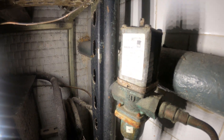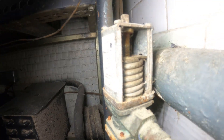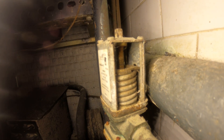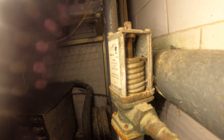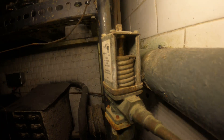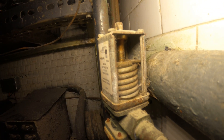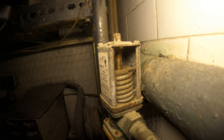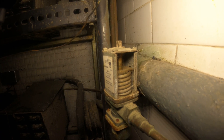This is the water-regulating valve — I did make a video on that and will link it in the description. If we look at the spring, it's pushed all the way down, so we have very little clearance from above. That's going to restrict the water flow and therefore increase our head pressure. This might be set up for winter. So let's go ahead and adjust the spring — bring it up — and that should give us a lower head pressure.